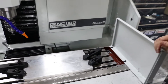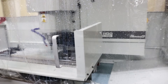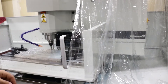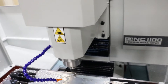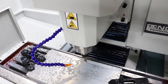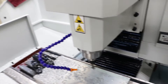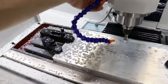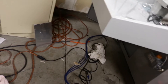Well, I went to face this part with my end mill and I noticed I wasn't really getting good flow with my pump. I'll turn it on so you can kind of listen to it. I don't think it sounds very healthy and I'm getting no pressure — like nothing. I've got my valve turned all the way on. The only thing I can think of at this point is to open up the reservoir where the pump is.